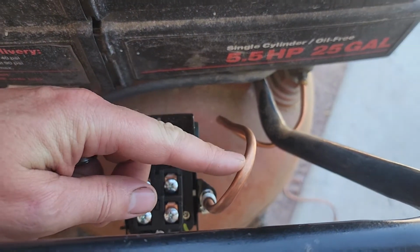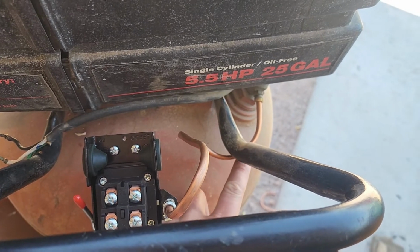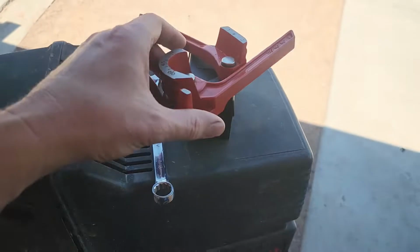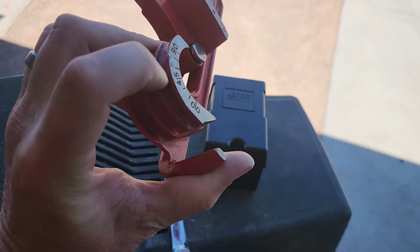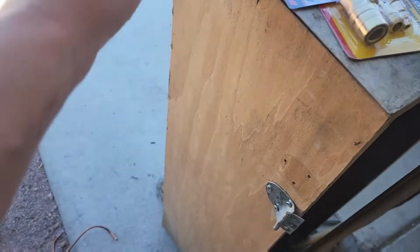So, this little thing right here, and then this bend under here, so hard to get this copper bent without kinking. I even use, like, I've got a brake line bender tool. I use that. Still, it was smashing it. It was kinking right here, kind of in the 45 area. Just kinking it flat.